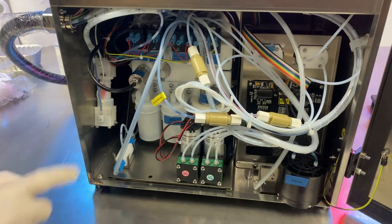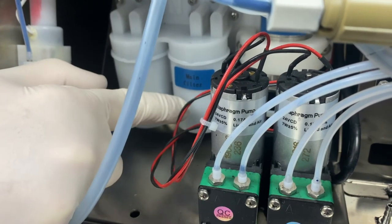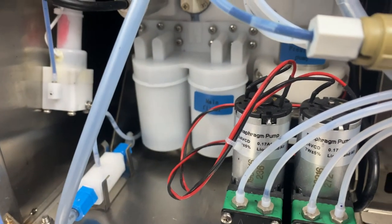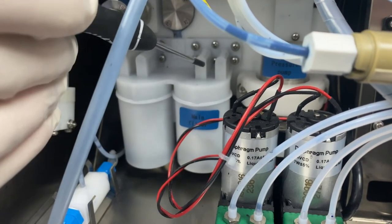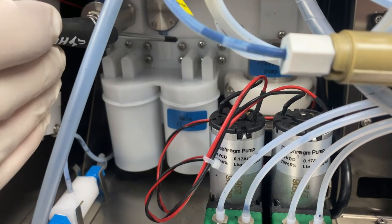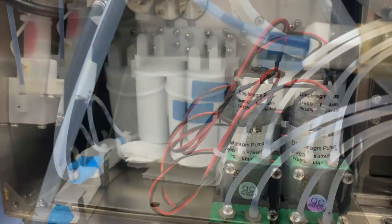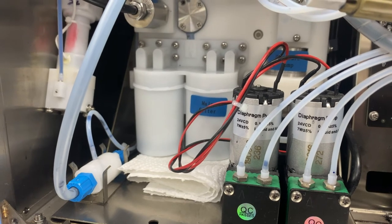Once you've got the inline filters replaced, the next filter we need to take out is the main filter. It will be labeled — you'll actually have a blue sticker on yours, and every Jetstream will have this. This is a large dual-chamber main filter. In order to replace it, there are 12 screws that bolt it to the hydraulic manifold, and we need to back out all 12 of those screws. Be mindful that the screws between the input and output of each filter chamber are a different length than the screws on the outside — keep these separate, as we will be reusing the screws. Slide a little piece of towel underneath the filter before pulling it out, as there might be a little residual fluid from the manifold when we remove it.